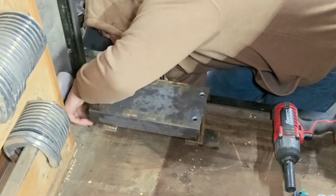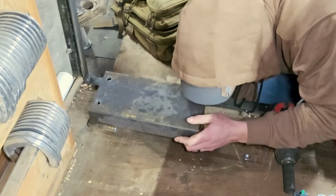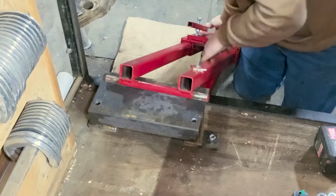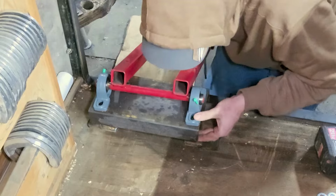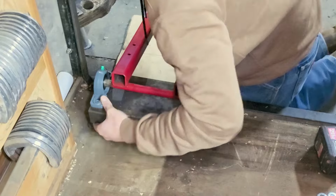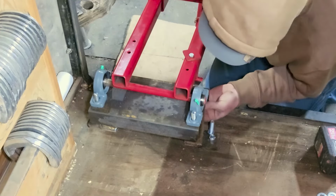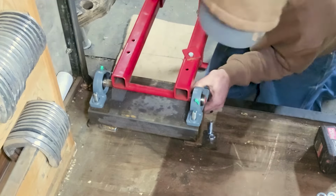I used a piece of angle iron left over from the mounting bracket that I made for the trailer to mount the Vanvil, to add a little bit more strength to the mount in the trailer so that I don't rip a bolt through the bottom of the plywood. The Vanvil comes with the bearings. It does not come with the bolts. The holes for the bearings for mounting the Vanvil are 1/2 inch. I used 2-inch bolts with washers and lock nuts. The lock nuts are a precaution to keep things from jiggling loose and rattling loose when I'm going down the road.